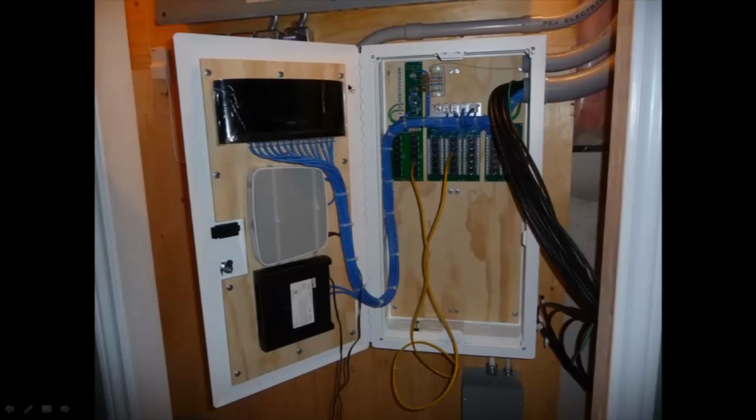So sure enough, the exposed metal did the trick. It bonded to the metal quite well. I couldn't even rip it off. I put a lot of force on it just to make sure, and it held pretty well, and I got the door panel mounted there. So lesson learned: the epoxy does not bond to powder coat. So there's the 3 components mounted there, and it's holding pretty well.